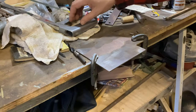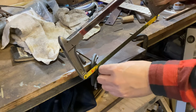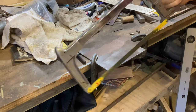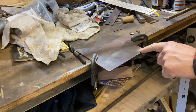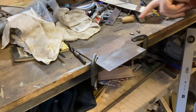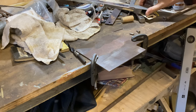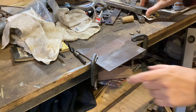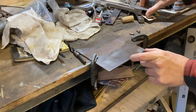This is a chunk of 1/8 inch 4130. I've got a line marked on it. I'm going to cut a couple of lengths off — one here, one here. The grain on this piece of 4130 runs along the sheet, and grain on 4130 matters. A couple of nice long pieces and then each one will make two cable tangs.